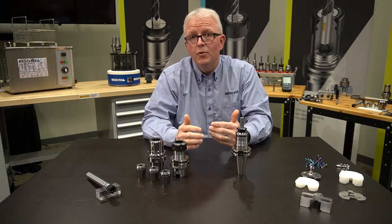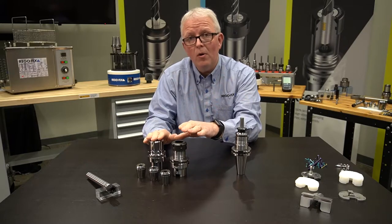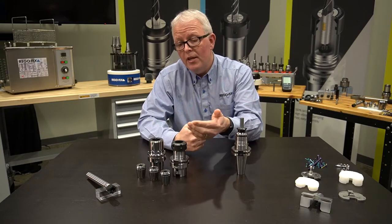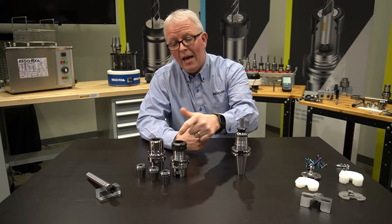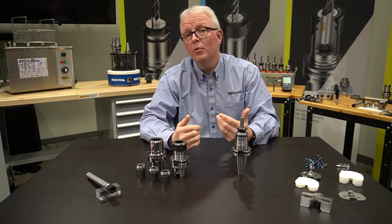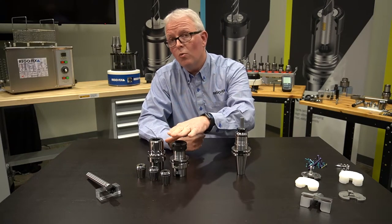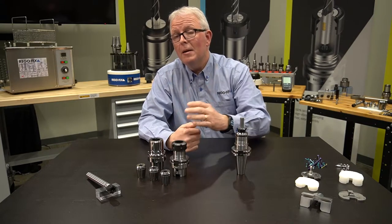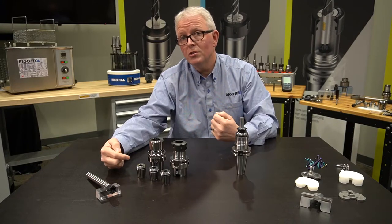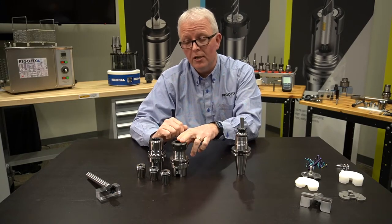Just like the Swiss type tooling that we offer, we offer a couple of different styles of ER or MR regular collet chucks. The regular ER style is going to give you one-tenth TIR from cavity to taper, and then you can select the different collet options to get the most accuracy out of it. Depending on your application, a regular ER collet chuck might be all that you need with a standard, UP, or MR style collet. But what happens when you need to do better than what a regular ER collet chuck can do?